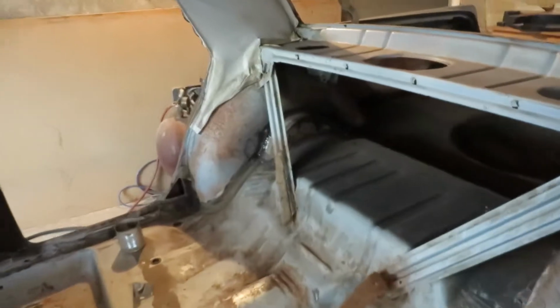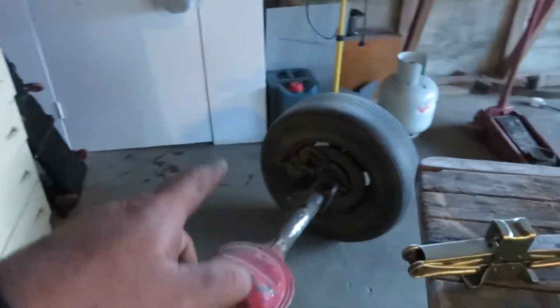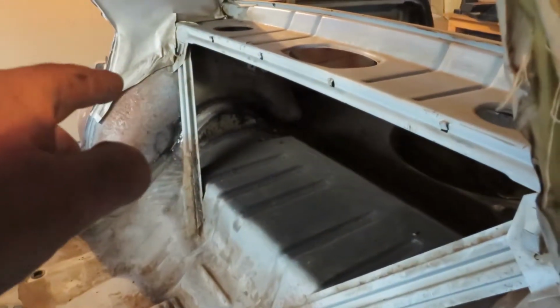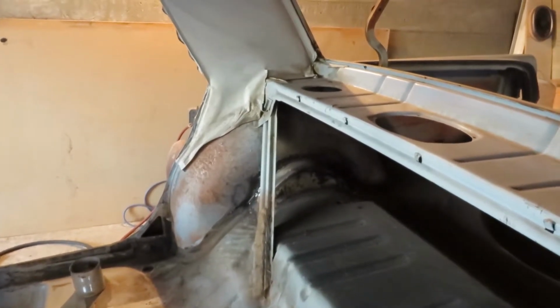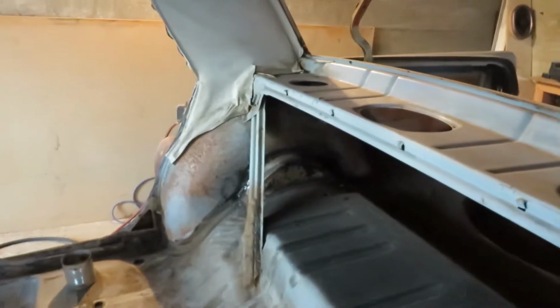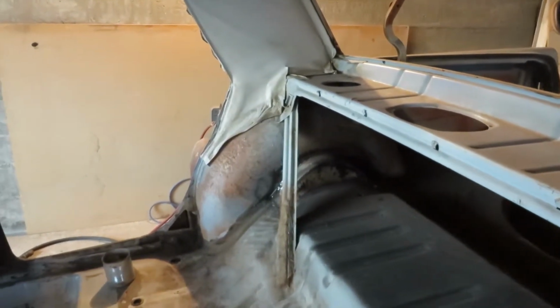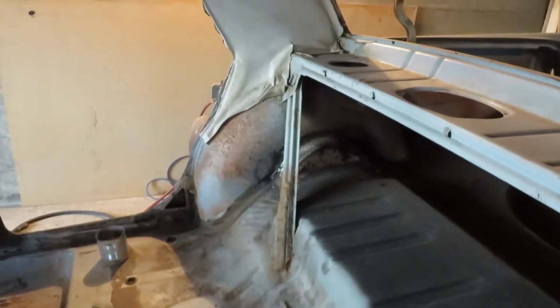and do it properly. I was going to get in where I'd modified these back pieces to accept the brakes for the handbrake levers, since they sit on top, since everything's so short, because the brakes can't sit in their natural position. I'd put these scallops on these inner guards, it's not actually into the chassis rail itself, but it's just an extra piece to allow plenty of clearance for that handbrake lever not coming up and hitting on the inner guard, which it was just doing with a full load, with people sitting in the back and everything. I tested it out years ago when I originally set the 9-inch up to fit